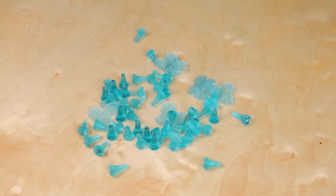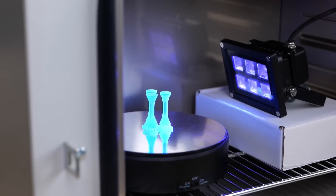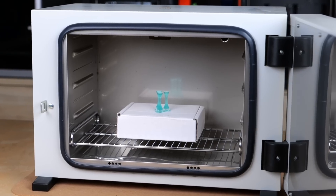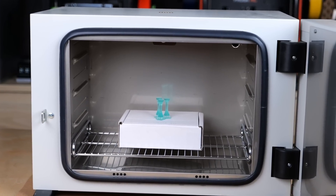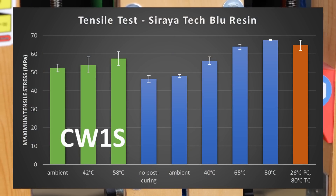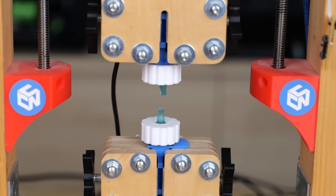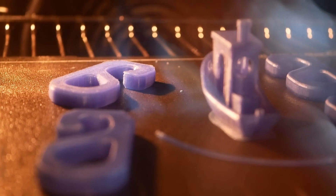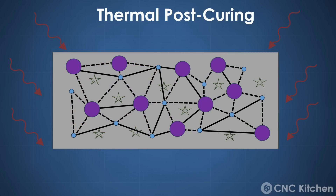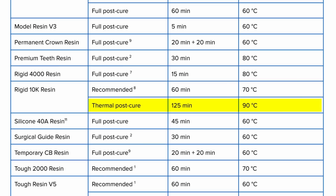I thought I was finished and started writing the script when I stumbled over something unexpected. I wanted to make the argument that you need both heat and UV light at the same time to get the curing advantage. To substantiate that claim, I tried putting one of the samples previously cured without heating into my 80°C oven for an hour, with no UV light — just sitting on a box. When testing these samples, I almost reached the strength of the parts that I UV-cured with heat. So it seems you even get a strength advantage if you anneal the parts in an oven after post-curing. When annealing PLA, you reduce internal stresses and increase crystallinity; on SLA prints, you seem to further cure the part and form as many bonds as possible between the polymer chains. Interestingly, Formlabs also gives thermal curing recommendations for some of their materials, which confirms these results.